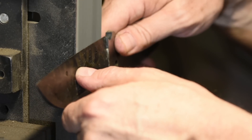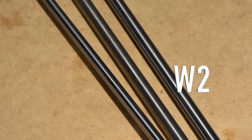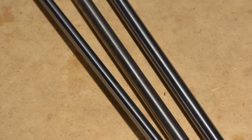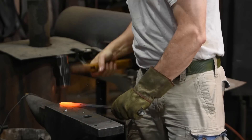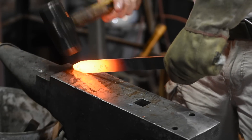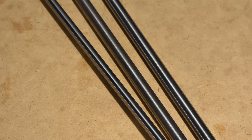There's also sort of a kissing cousin, W-2 — about the same composition, but with a tiny amount of vanadium added, which helps with wear resistance and also has some heat treating advantages. Personally, I prefer W-2 over W-1 in all cases, but unfortunately W-2 is not widely available. A lot of forging guys use it, but you have to find it from specialty vendors in most cases.